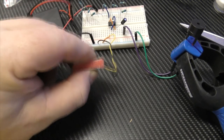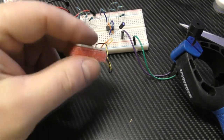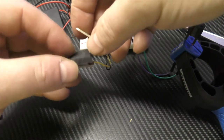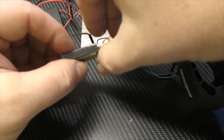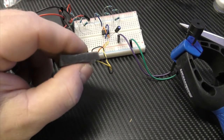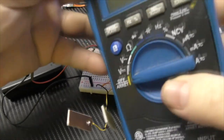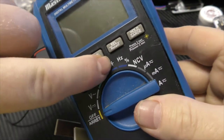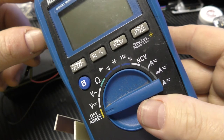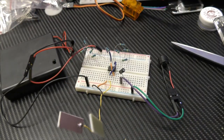Now the pink foam might actually be interfering a little here because this is anti-static foam used for transporting static-sensitive electronic components. This black foam, however, is just plain old closed cell foam I actually cut off from a foam paint brush. It's very soft and squishable, so it would probably be better suited for our figurative pressure sensor. My multimeter actually has a capacitance measuring option, but the capacitance was too small to register. However, I can also measure frequency with this multimeter, and if we know the resistances in the timer circuit, we can calculate the capacitance.